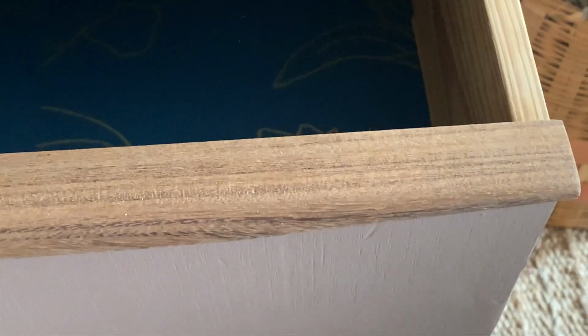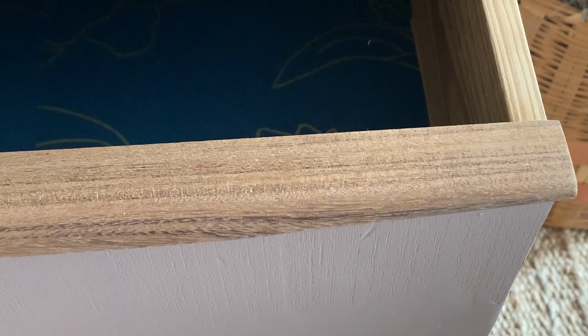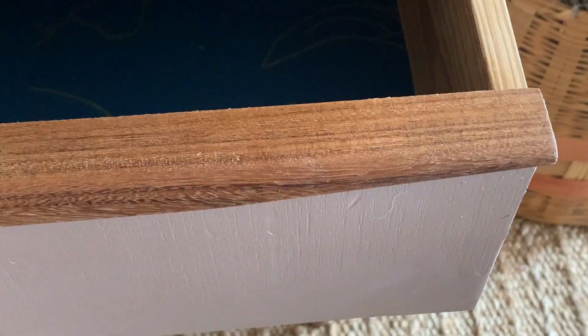So I'm waxing the teak. I think somehow it will be okay. I am being really careful to wipe back any excess, both on the paint as well as the wood accents. Actually, the teak looks very happy to me. It started to glow and it lost its slightly ashy hue. Honestly, if you like a more grayish undertone, you could probably leave it raw.